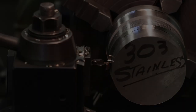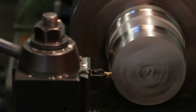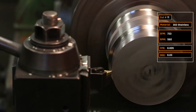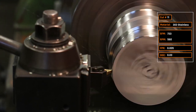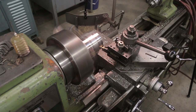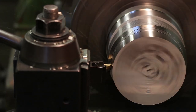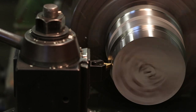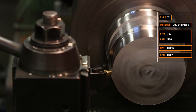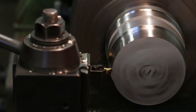Cut number eleven: switching from the Sumitomo roughing insert to the Sumitomo finishing insert. It's still a DNMG insert but a 431 instead of a 432 — a smaller nose radius. Starting at 733 surface feet per minute, five thousandths feed per rev, 30-thou depth of cut. If you look closely you can see a real tight curl right out at the tip, and that's what makes it break. Cut number twelve: dropping down to one thousandth of an inch radial depth of cut — a whisper cut for hitting your tolerance.